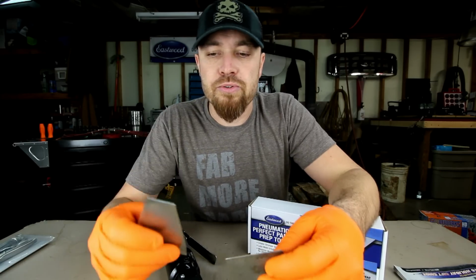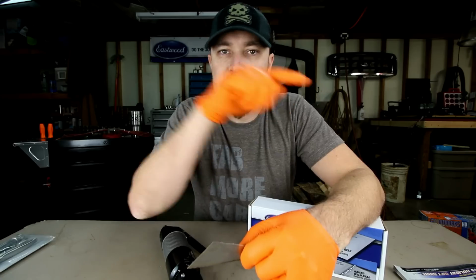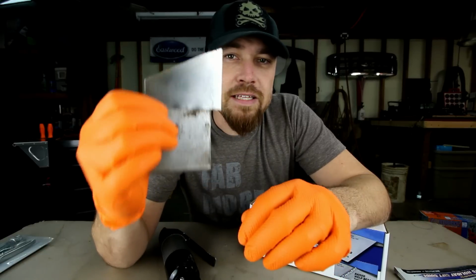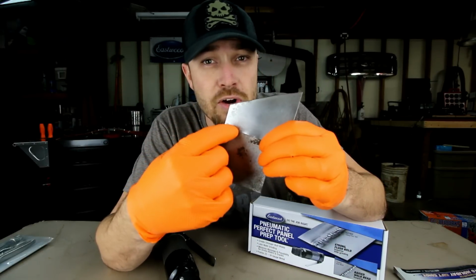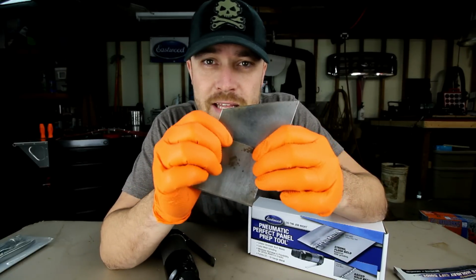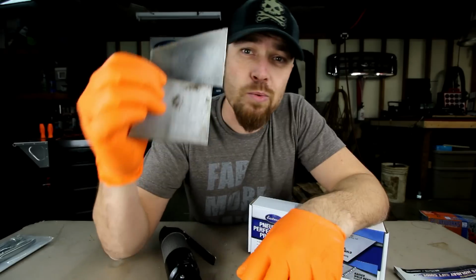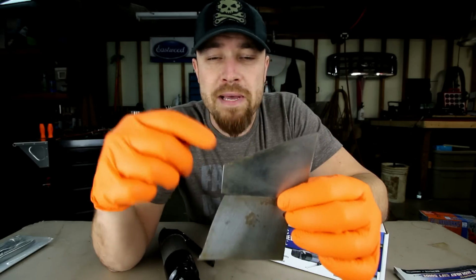So anytime you're needing to weld sheet metal together, say you're gonna replace a panel on your car, a rear quarter panel. A lot of times you have to cut it out, put a new piece in there. Sheet metal, you have to weld back together. The sheet metal itself is really thin. If you just take the sheet metal and butt weld it like it is, your weld is gonna sit on top of the sheet metal. You're gonna have to grind that off. When you grind that off, guess what? You just ground off all your strength. There's no more strength really left in that weld. Chances are you probably didn't get full penetration, so you just ground off all your weld. The sheet metal there is not as thick as it was originally. You just barely got any kind of material hanging on. And so this tool is made to fix that problem.